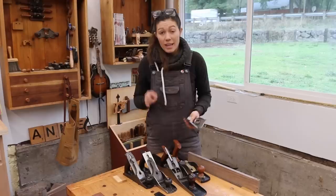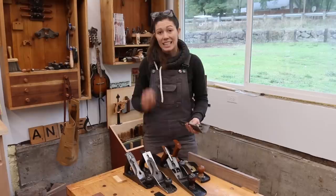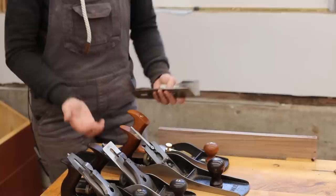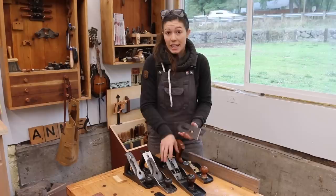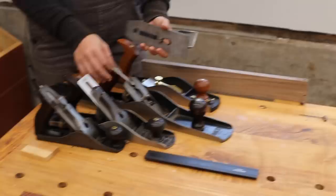The first thing is that this tool just has a whole lot fewer parts than these other tools do. If there's one thing I like to emphasize with young or inexperienced woodworkers, it's the importance of having the ability to eliminate as many variables in your work as possible, so if something's going wrong you can easily hone in and isolate what it is and fix it. One of the simplest differences between this tool and a traditional plane is the number of moving parts. This tool has a frog, and it is possible that it could be cocked laterally, which would cause you all kinds of problems.